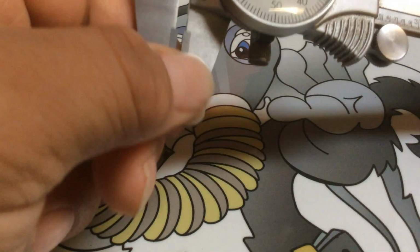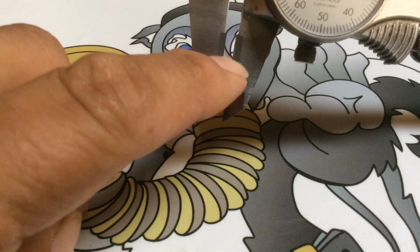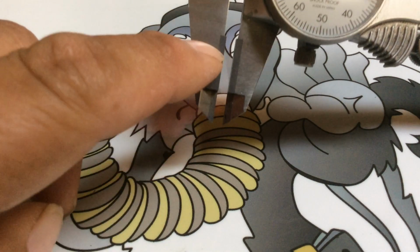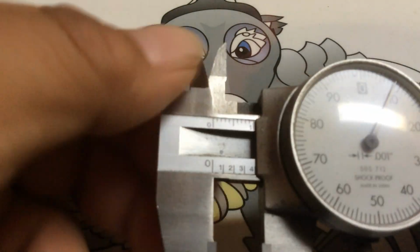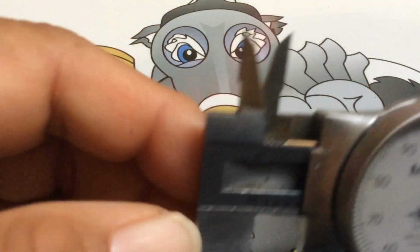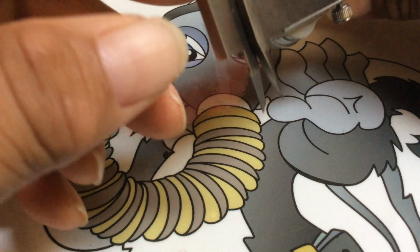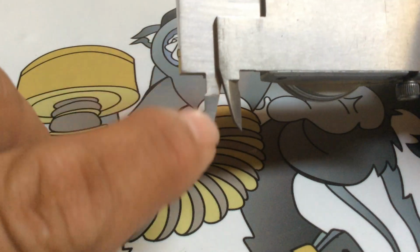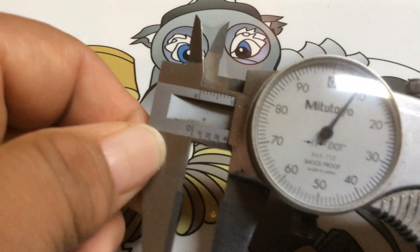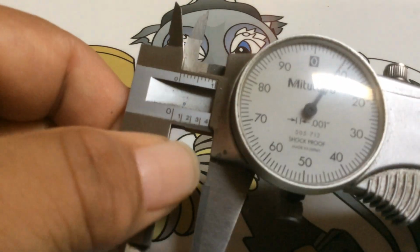Now, something very critical. Again, you've got to get them with the carbide tip. You see that dark color right there? That's carbide. You get the carbide on the OD. You get the carbide on the, I call them rabbit ears, but they're the IDs. You can see the dark color right there. And you can see the dark color between, there we go, right here and here. See, these are carbide. The carbide tip. You can see the dark color, there's a good shot. Color differentiation, those are carbide.